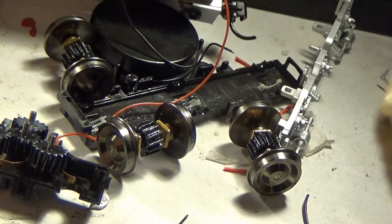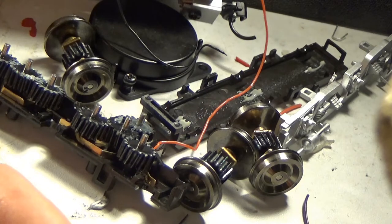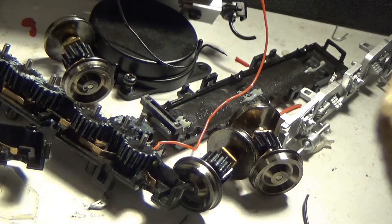So I had to break out my soldering iron yet again and solder that wire, the black wire, back up to that point. Now, for some reason, the footage of this doesn't exist. I don't know what happened to it. So you'll have to just take my word for it that I did it, and it was quite a tedious mess. I think that's why I stopped videoing, because it was such a pain to get this done, as that contact line is really squeezed into this very tight area in that truck itself, and if not perfectly assembled and perfectly soldered, it won't go in correctly.